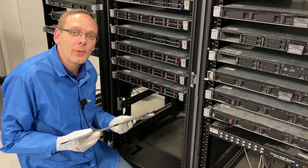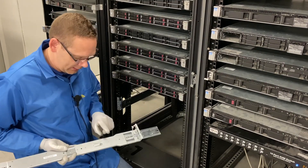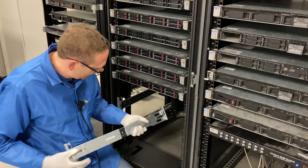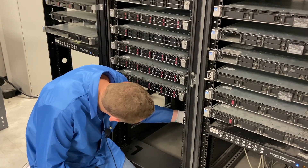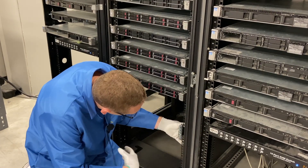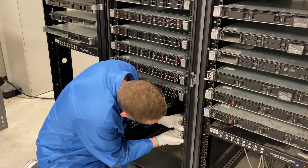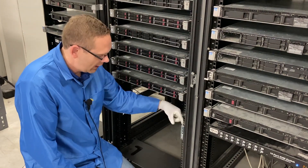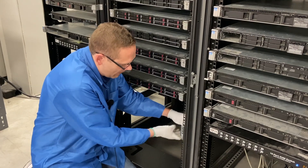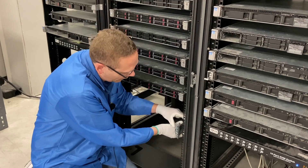Now we're doing the right rail. You'll notice it says 'Front R' right here on the front, and on the backside it says 'front right' and 'rear,' so that tells you how to line everything up. We're again going to do rack units 8 and 9. Angel will hook them up on the back to start, and then I'll click these two in for 8 and 9 on the front. It'll just pop into place — it's fully locked in. If I wanted to remove it, I'd just push this button and it would come back out. That's how you install and remove the outer rails. We'll go ahead and lock it back in.